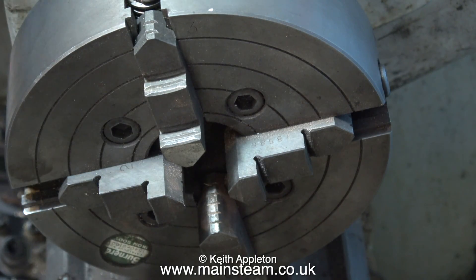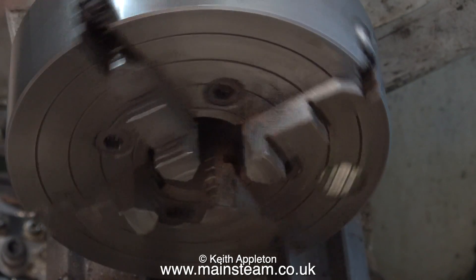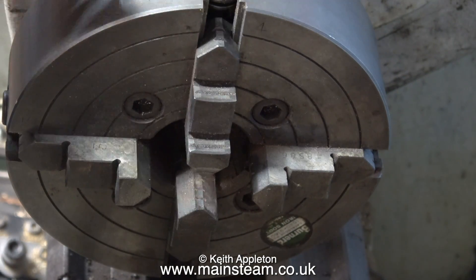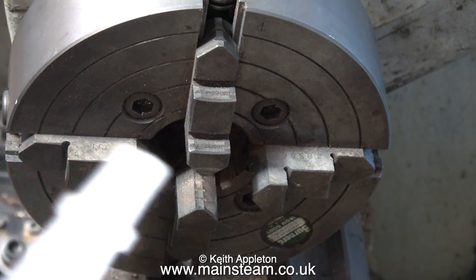In place of the three-jaw chuck I'm fitting my four-jaw chuck. What I'm about to do is clamp one of the brake beams in the four-jaw chuck to machine the end of it. And here, on purpose, I'm doing something else wrong — I'm tightening the chuck onto the spindle using the chuck key. This is not too smart because you can damage the chuck this way. It's a much better idea to use a long piece of bar in between the chuck jaws, and do not over-tighten the chuck on the lathe spindle.